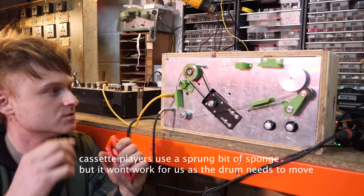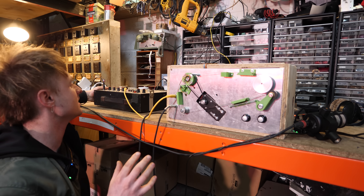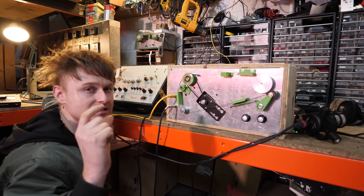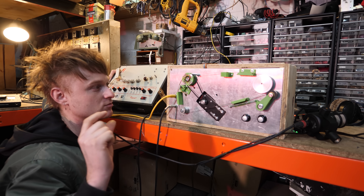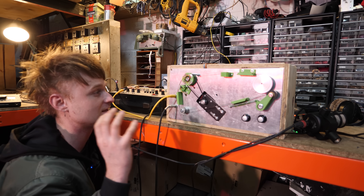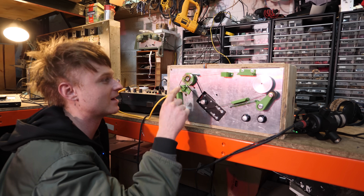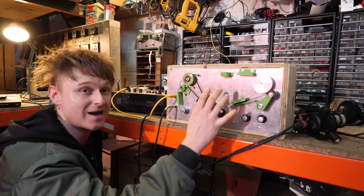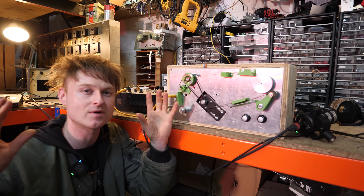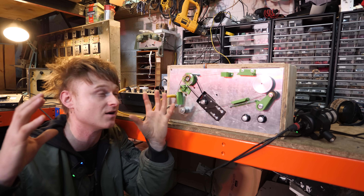Also I didn't finish the circuitry for the tape record head. I ended up using the circuitry in the back of this Copycat. It turns out you need to add an AC carrier signal - an AC bias - which makes it record onto the ferrous material much nicer and you get a much higher definition. It sounds not great at the minute. In Mark II I'm going to have different tape heads, much better circuitry, and quarter-inch tape to make this all work. I also found it worked really well putting drums through it - it sounds quite nice even in its lo-fi way.